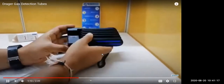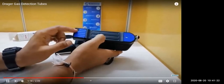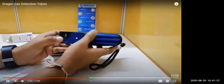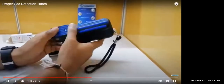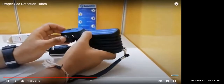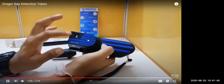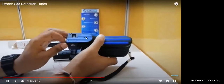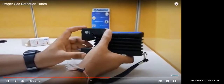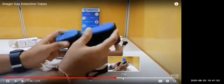There are several parts of this instrument: the tube opener with a ceramic cutter, so you have one cutter here and also a separate cutter. The rubber bellows, called the bellow pump, the lower pump plate, and the lower and upper stroke plates. Then the stroke counter and the reset button for the counter, which will give you the count of how many pumps you have done, a white or gray light and an end-of-stroke indicator for how much gas is coming in or not, then the bolt to secure the lower pumping plate in place.